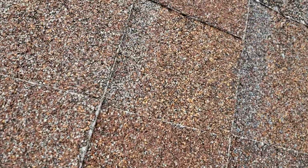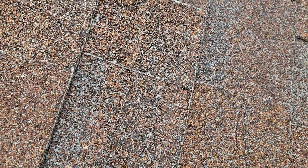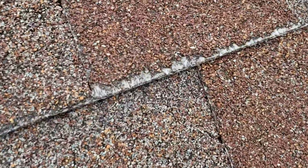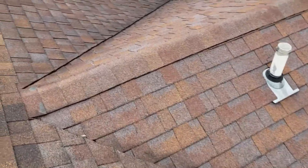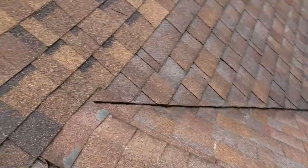We've got a lot of the leading edge, the fiberglass starting to show through. When you start to see the fiberglass mat show through the shingles, that's pretty much your shingles' cry for help. It's letting you know that it's getting to the point where it's played out. That's how they naturally wear out, nothing specific to your house. When the granules are gone, you start to lose the weatherproofing of it.